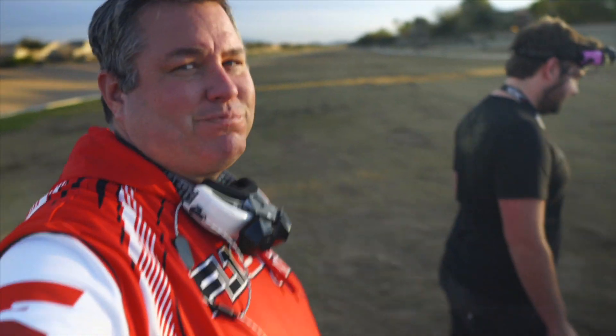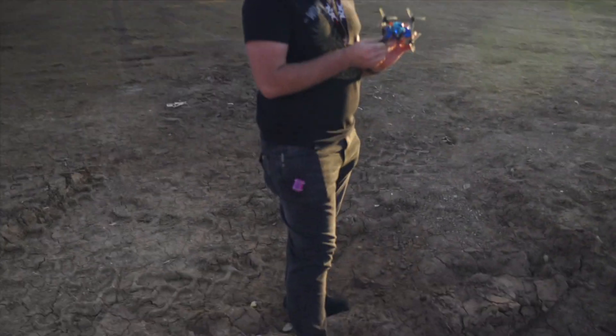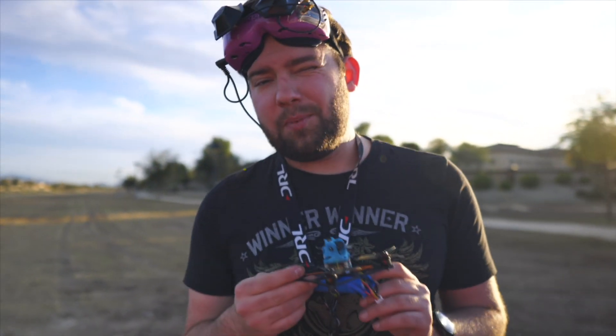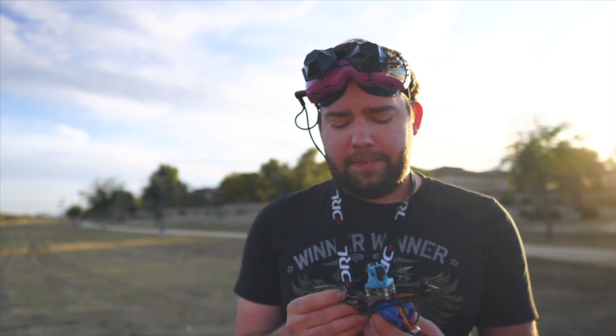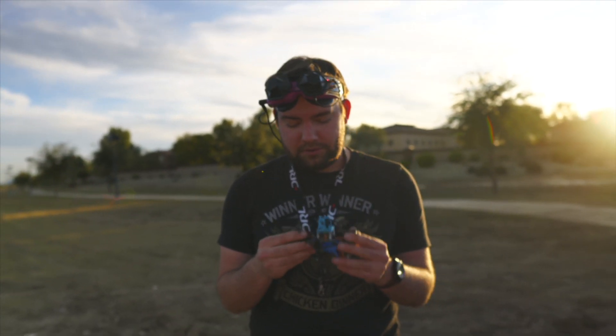So it fell out of the sky. Luckily it was close by so we didn't have to go far. We think there might be something a little wrong, but we're checking it out now. Touching all the motors — cold, cold, cold, cold — all the motors are ice cold. So there was no problem with the quad. The back right motor was smoking hot last time because the way one pilot was flying, he was basically sitting at an angle, full throttling, getting nice panning shots of the sunset for about eight straight minutes.